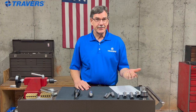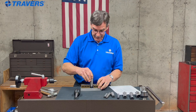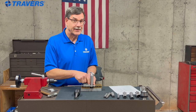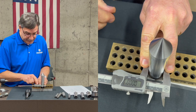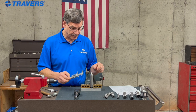One other way to measure a Morse taper is taper per inch. For that, we're going to use the help of a couple of 1-2-3 blocks and a ground aluminum plate. I'm going to take my Morse taper shank, put it between the 1-2-3 blocks. I'll use digital calipers — in the inch position, that's important. I'm holding the jaws down on the 1-2-3 blocks, closing them in against the taper, and that's where I'm going to zero the calipers. That's why I like to use digital calipers for this example. So we take that off, and now the calipers are zeroed right to that position on the taper.